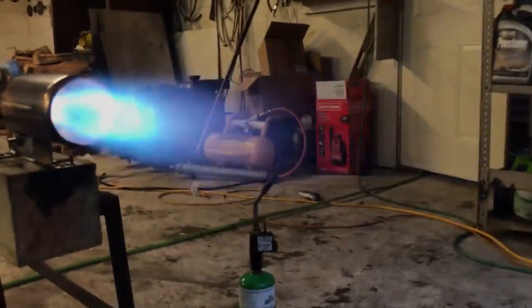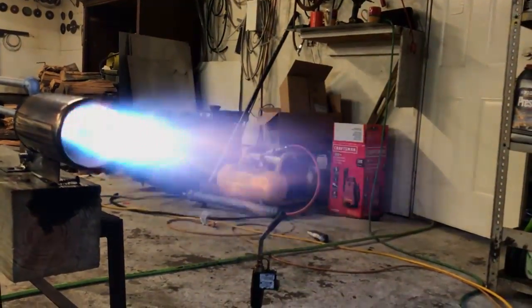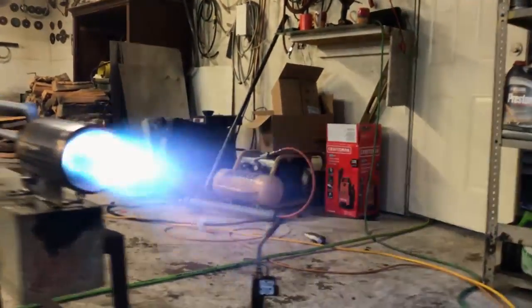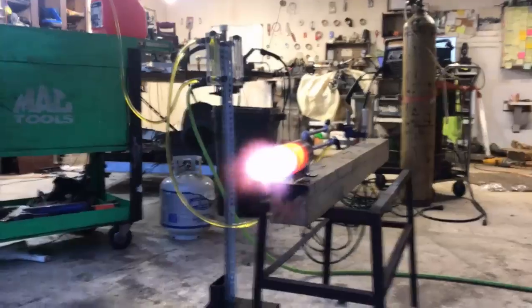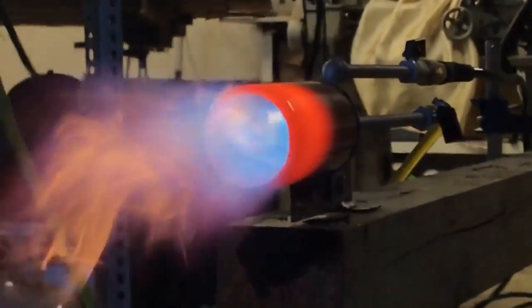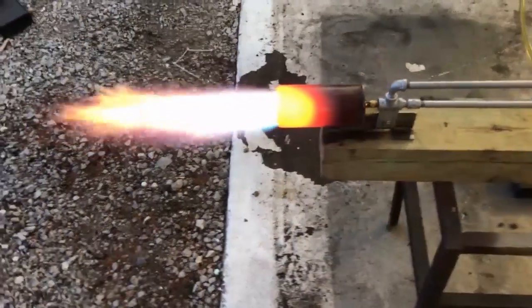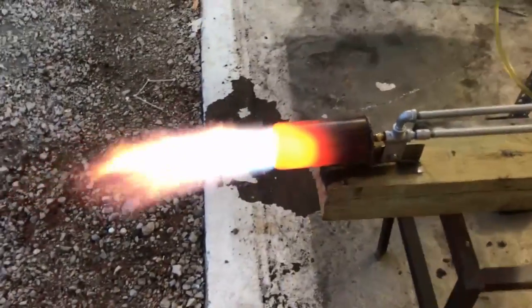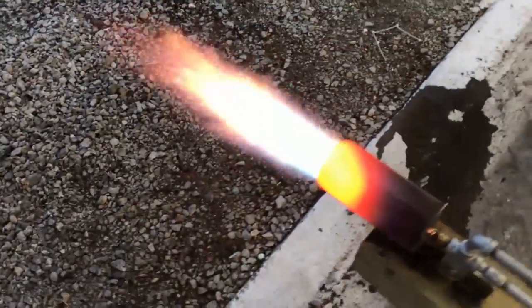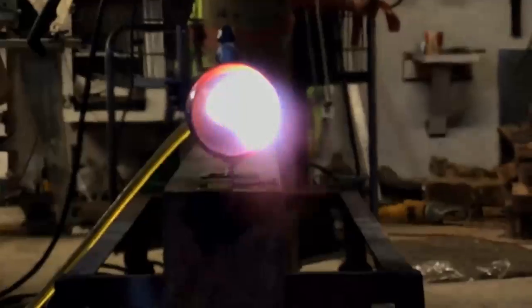You can see we just have nothing. And then this is the system with the properly aligned inner pinstock. See that flame jumps around quite a bit there — some very strange things still going on inside of there. We definitely want to get some more secondary air. So that's going to be the next move. You can see it's just starved of air. That color is just too yellow — this is diesel, we should be pure blue.